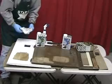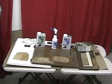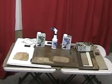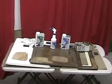And again, coming back with our terry cloth towel. You could very easily refinish all three of those immediately, or you could come back with a 250 or 300 grit sandpaper, just lighten that wood up a little bit. You are ready for a new finish.